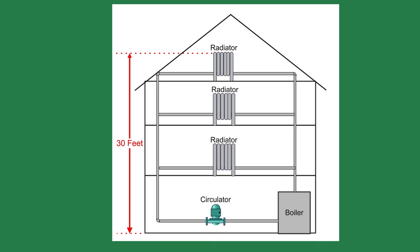The average room height for a home is 9 feet, and I usually round it to about 10. So if you want to ensure water is at the highest radiator of a two-story home, I use 20 feet, which would be 10 psi. For commercial buildings, I estimate the height to be 15 feet for each story.